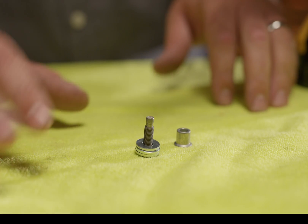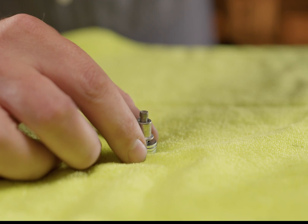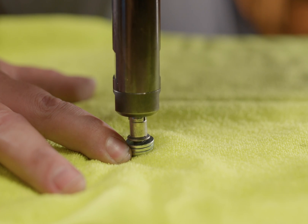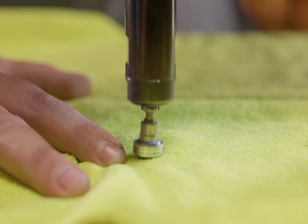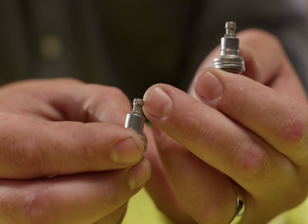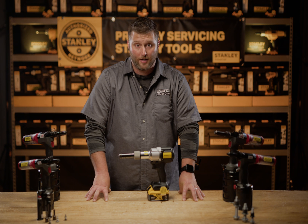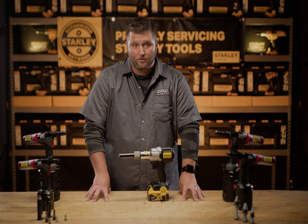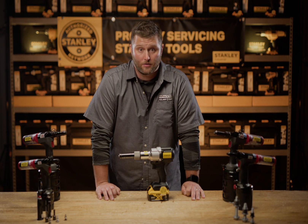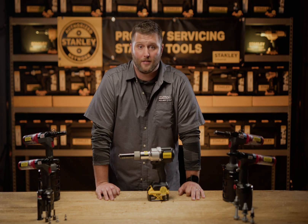Now that we have the stroke set up, we're going to test the fastener. I'm going to slide the collar on, hold the fastener making sure your fingers are out of the way so they don't get pinched, and then pull the trigger. Here's an example of a bad fastener setting — you can see the metal is stripped off the top. You can fine-tune the stroke setter by inserting a two millimeter allen wrench into the front end of the collet. If it is over-swaging, meaning pulling metal off the top of the pin, you need to reduce the stroke by turning the stroke setter clockwise. This is a very important step as it keeps your collets lasting longer and avoids over-exerting the tool.